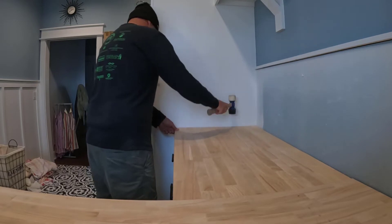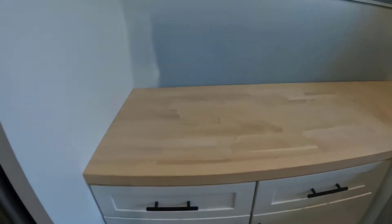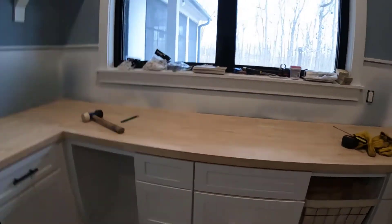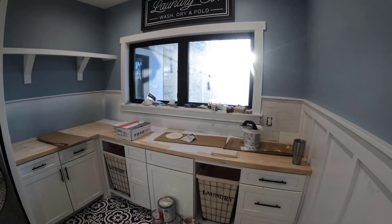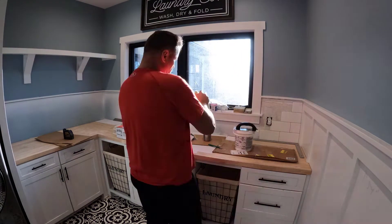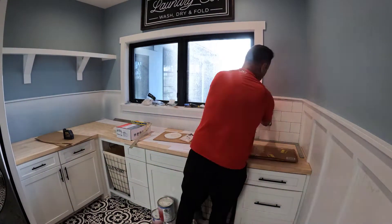I put this little section in — it's pretty tight, firmer than I thought it would be. I just pounded it in and at that point I wasn't taking it back out. I wanted to put bolts in that seam but decided not to because it fits so well. I was able to sneak the countertop up a little, put some silicone underneath, and screw it in at the back where the tile is. I have concerns about expansion and contraction at the joint, so I went with my gut and left it as is.